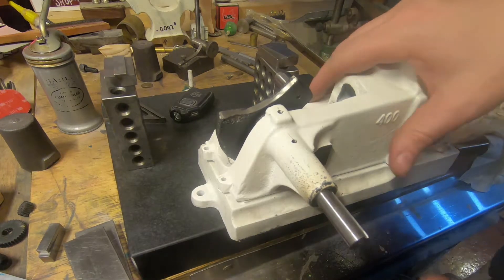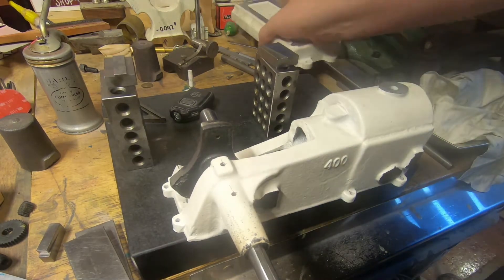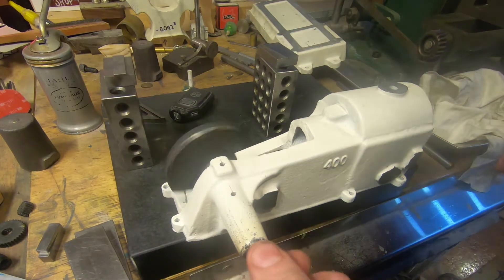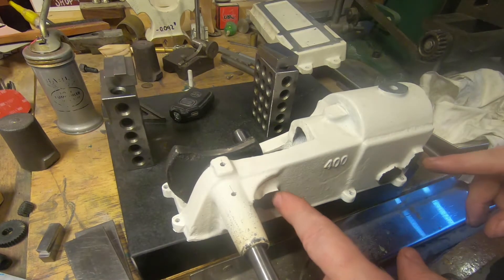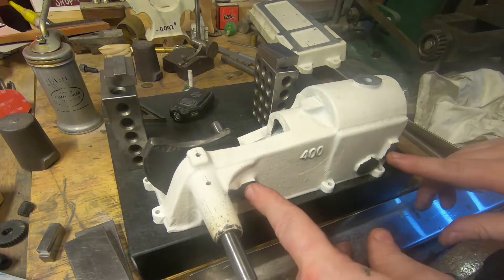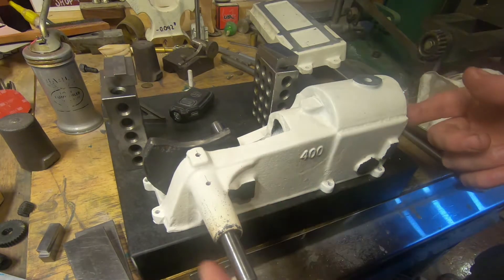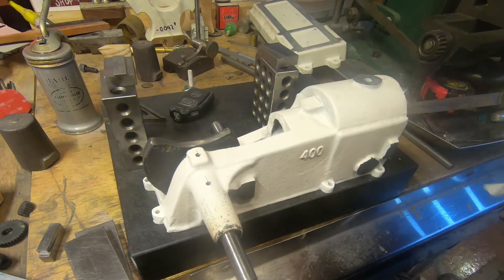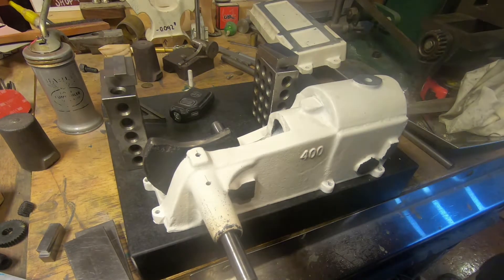We do as Tom Lipton says and interrogate the casting. I've been messing with this a bit — full disclaimer, I've done some alterations to these two alignment points, which are datum points for the bore and for the crankshaft. Where we had them before they were out a bit, but I've just messed with them until I've got them right.